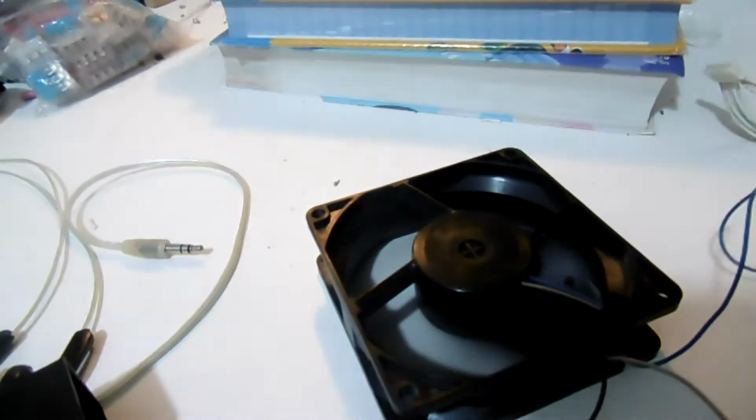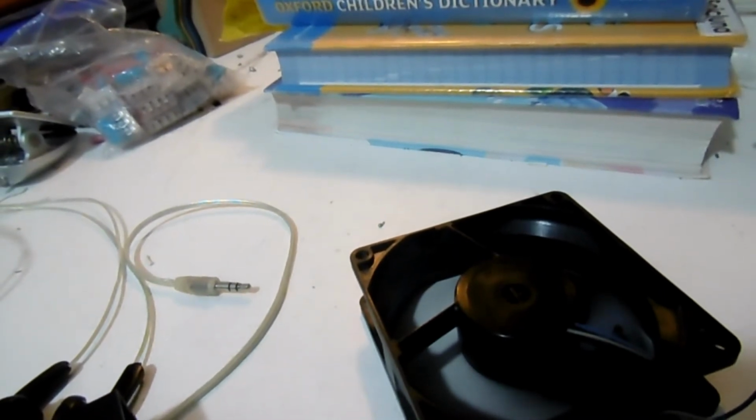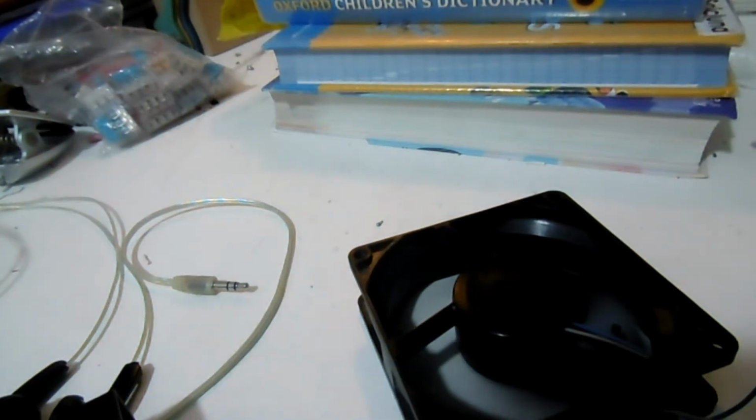And now, watch the lights as I adjust the voltage. Watch the fan as I adjust the voltage. This is a very terrible setup. Anyway, watch the speed of the fan as I adjust the voltage. 12 volts, everything good. At 9 volts, I see the speed of the fan and the brightness of the bulb reduce significantly. If I reduce it to 7.5, everything reduces even more.